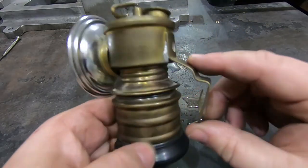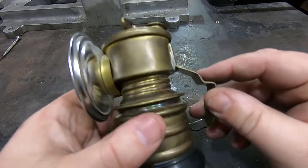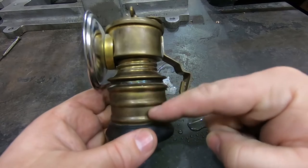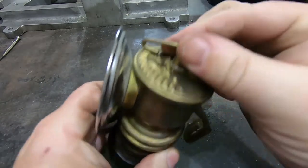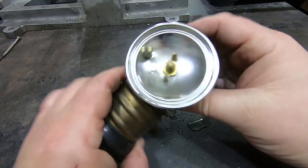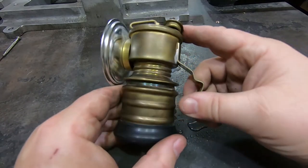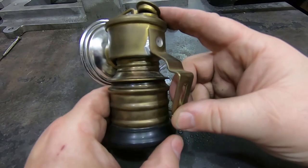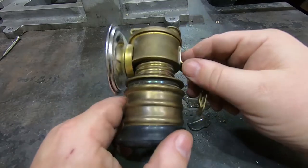Slightly less out of date are lamps like this miner's lamp, which I recently acquired. I've wanted to get one of these for a long time, mostly because I thought it'd be funny to wear around at Burning Man. This lamp keeps water up here, you put chunks of calcium carbide down there, and this lets water drip down — the farther you turn it, the faster it drips. That drips down, generates acetylene, which comes out here, burns, and generates light. These were used extensively in miners' lamps, old bicycle lamps, and handheld lanterns for railroads. Back when batteries really sucked, this was a more reliable way to generate light in many different situations.